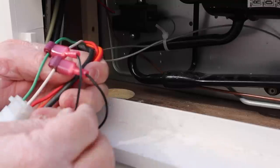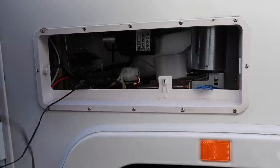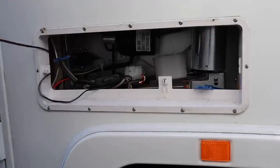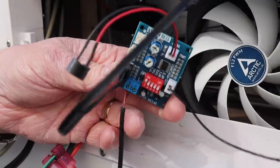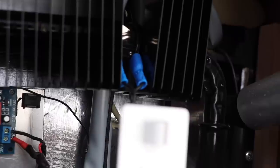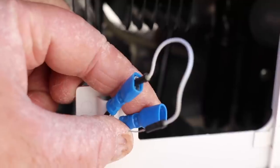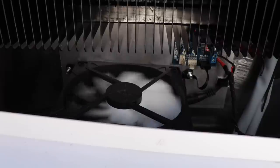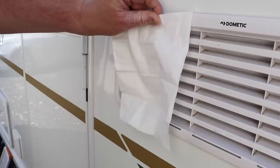In this instance the green wire is 12 volts and the white wire is the ground. The connectors simply squeeze onto the cable to make a T-connection. I've connected the main 12-volt switch and cable-tied it onto the bundled cables at the bottom of the fridge, then run the cable up to the top vent along with the existing cabling, cable-tying the new wire to the existing loom to keep it neat. Just to test everything, I hook up to the 12-volt power source with a spare fan and controller and confirm it's all working fine. With everything installed, I bridge the thermal switch to allow current to flow and confirm the fans spin and the controller is working. Reinstalling the vent cover, there's good airflow — a little suction from the bottom vent and definitely air coming out of the top vent.